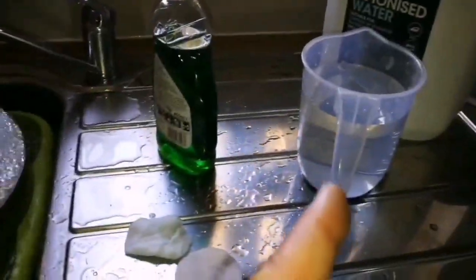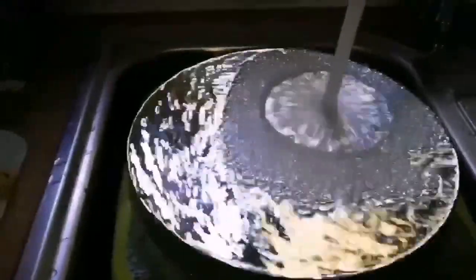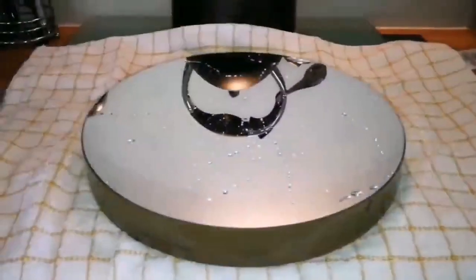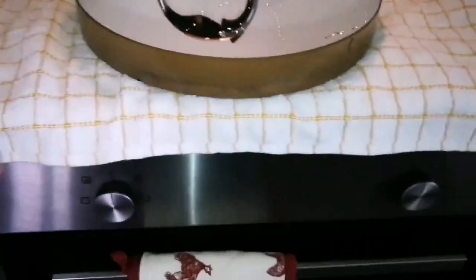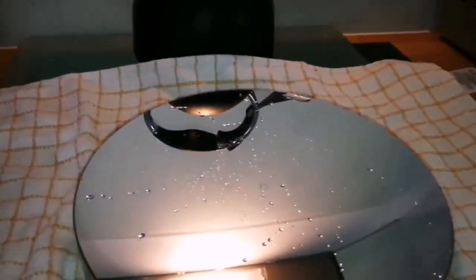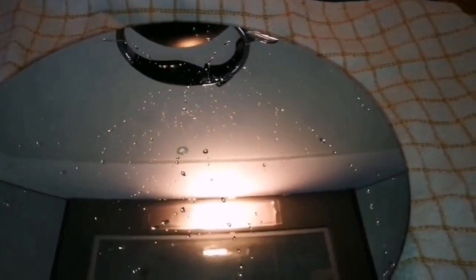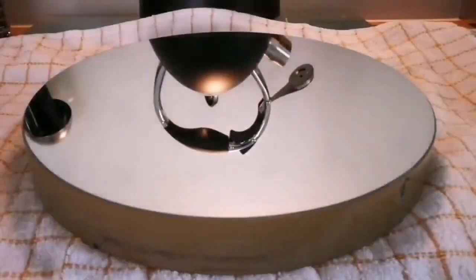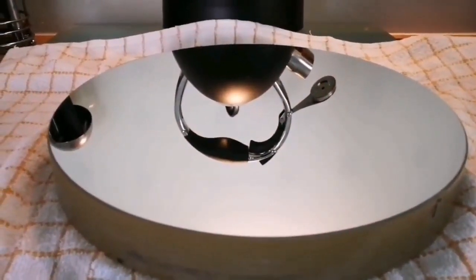After rinsing, I bring it to the tap water and then use deionized water to remove the small droplets. To dry the mirror, I use tissue — bend it into a sharp point and absorb the water droplets one by one. That method works really well. I may also try an air blower to blow some water away, and whatever remains is absorbed by the tissue. The mirror already looks really nice and shiny.